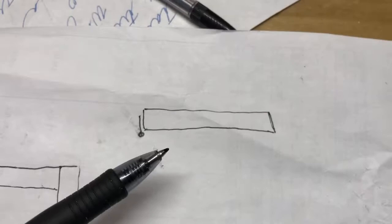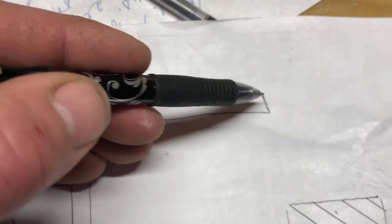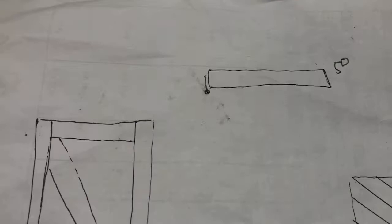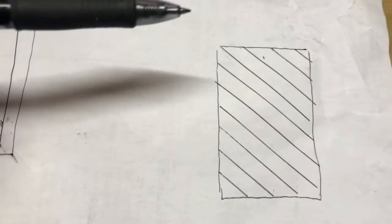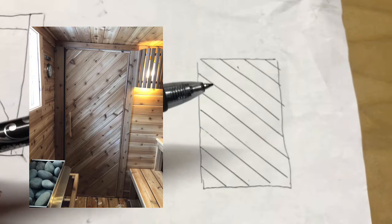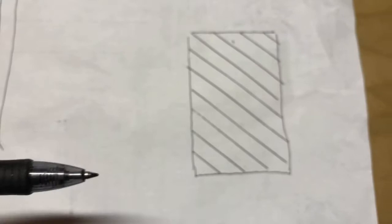This is the hinge side, and we need to make this side a little bit on the bevel because when you're closing it, this little corner could be hitting the door jamb. So just like 5 degrees or something like that - it's 5 degrees bevel and we have to calculate that. From the inside of the door we're gonna put cedar beadboard, same as you see on the ceiling and the wall, and the beadboard is gonna be diagonal to make the door a little bit stronger.